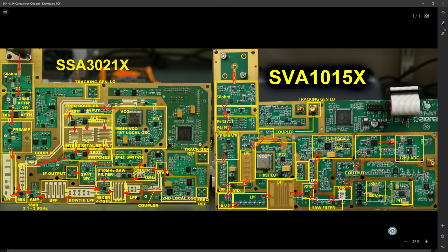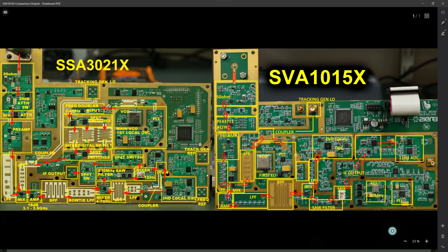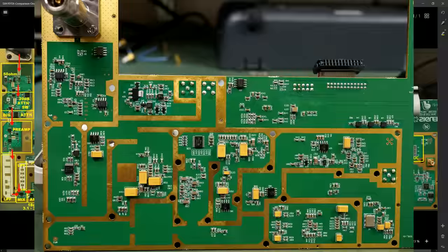So from a functional block diagram point of view, it's very similar but at a different performance level to the original 3000 model - exactly what you'd expect, because it's the same topology spectrum analyzer. It's all digital IF, so it's got to get the intermediate frequency output and then digitize all that. At this point we don't readily see any huge differences for the VNA - we've got this extra circuitry up here and an unpopulated little RF connector, plus the new VNA model has significantly different components.